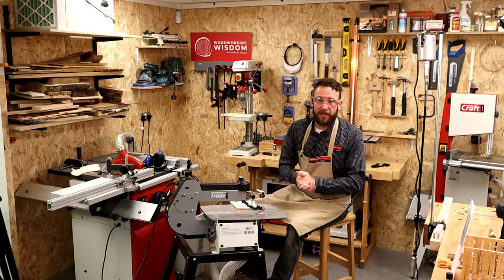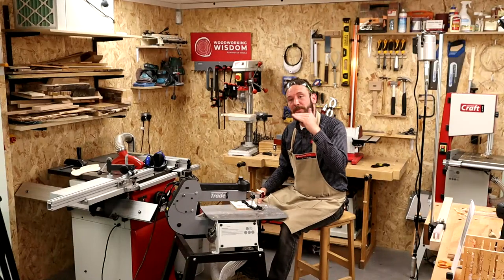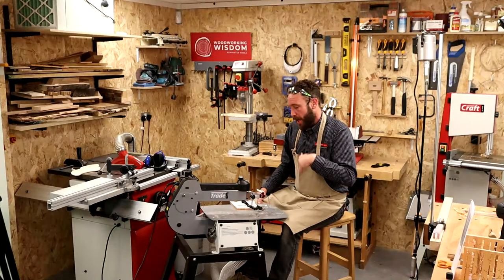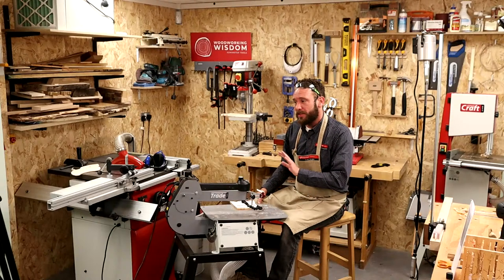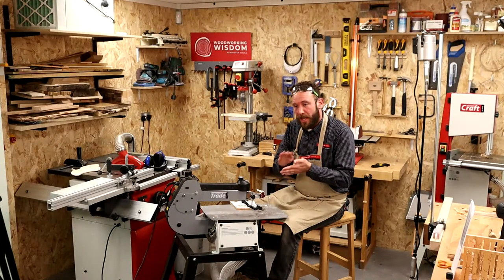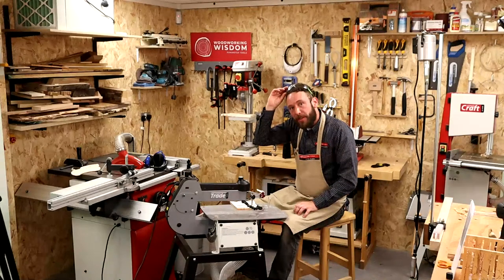I would recommend quite strongly those modified geometry ones. They've got the best of all the things. They're kind of skip tooth, so they've got really good waste clearance, so you can use thicker material. They've got that upwards facing tooth. They're a shaped tooth as well, so they have a little grind on them. Even though they're tiny millimeter sized teeth, they're actually shaped. If you've not had a go with those before, they're the ones I would definitely recommend.